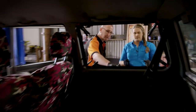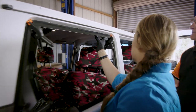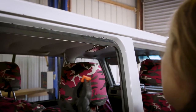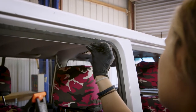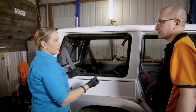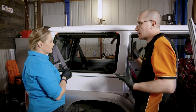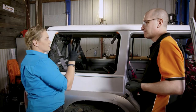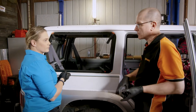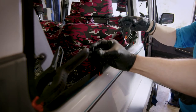So now if we stand back, we can see there's a difference in gaps — at the top and the bottom, front and back. So just push on that. You may just need to release this clamp as it's sitting on the edge of the rubber. Release that clamp — it won't go anywhere. Push that up, adjust it to where you want it and pop your clamp back on, and she looks pretty good. The glue actually dries with moisture — humidity rather than air drying, so it absorbs moisture to dry. You can start working on it within 24 hours in most cases. So now all we do is clamp it all up.